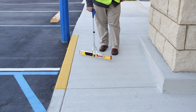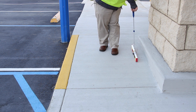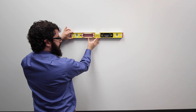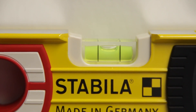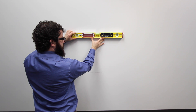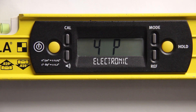If measuring slopes both vertically and horizontally, you need to complete a four-point calibration for your slope meter. To do that, place the slope meter along the wall or other surface, making sure that the horizontal bubble is directly in the center of the two vertical, parallel lines. With the slope meter on, locate the buttons marked CAL and MODE and press the buttons simultaneously. The number 4 and the letter P should display on your digital screen. Press the two buttons again simultaneously to begin the four-point calibration process.